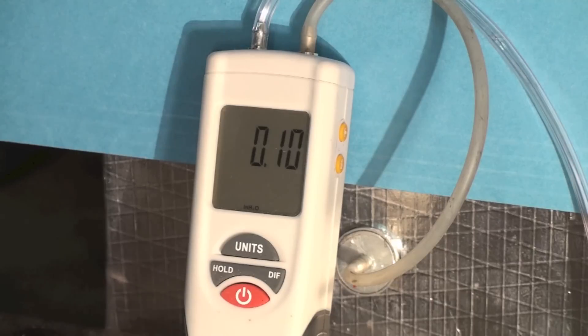That's pretty close to what you should expect — some sources say it should be 20% of the maximum. This is a 0.5 inch water column furnace, meaning the maximum external static pressure it can have. We're using up one-tenth of that right here, which is about 20%. By the way, when I'm doing these filter tests, I'm using all new filters — not used ones.